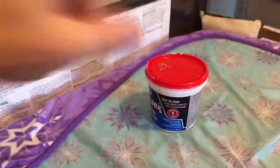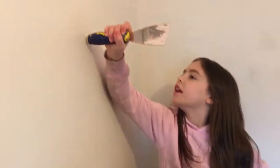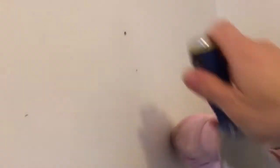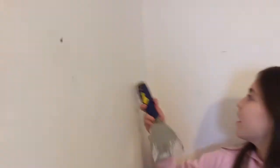So what do you do first? We have a big old hole — what are we gonna do with it? We're going to fill it in with this purple color-changing spackle. But before we do that, we need to make a little dent in there to recess the hole. You can take the corner and push it in just to recess it a little bit. That'll give the mud a little more to grip so it won't pop out.